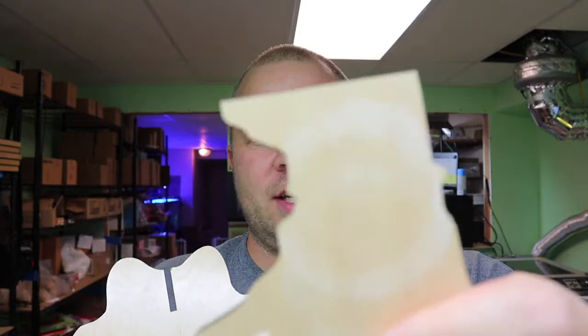I like playing around with this kind of stuff, making things up and having fun with it. If you watched my previous video about coasters and how much money you can make, I'll link it up here. A couple people were asking how to seal the product when making wood coasters. I did a regular clear coat on one and lacquer on another. I put ice in a cup on each one every day for seven days. The one with clear coat has stains on it; the lacquer one does not. Use the lacquer.